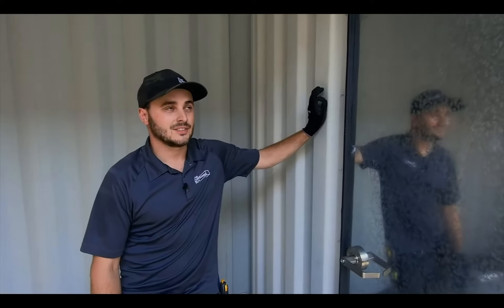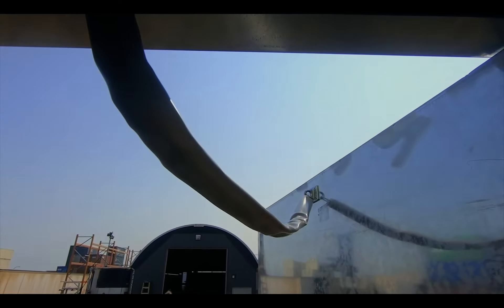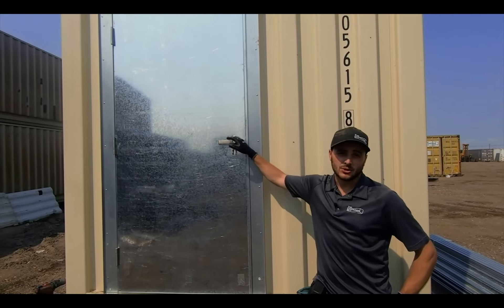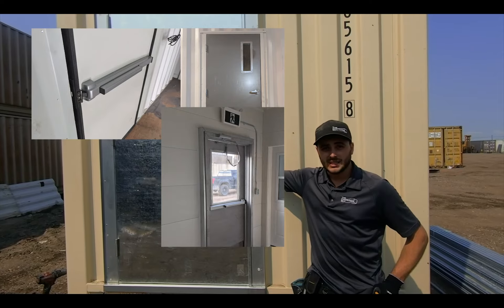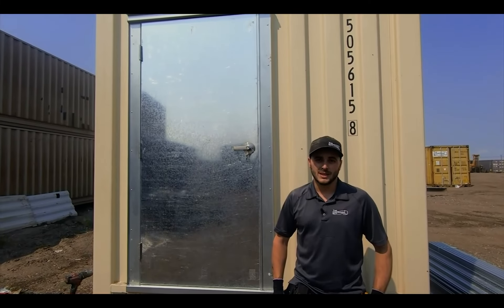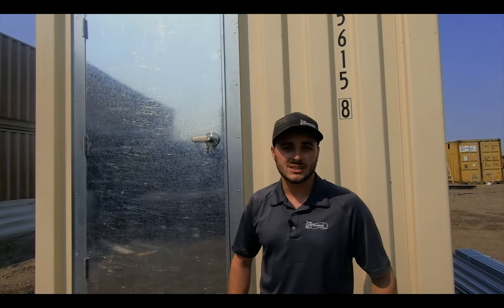The final closing touches for this door: we include standard a storm chain, which installs in the header and on the door. Basically when it gets to 90 degrees or just over, it stops the door from over-rotating and putting extra stress on the hinges. The hardware included is the locking door lever and a storm chain or check chain. Other options available are the panic hardware or crash bar, a sight glass option, a half glass option, and also a self-closing device. That right there is the installation instructions for the Container Modification World Man Door. If you like this video, please give it a like, subscribe to our channel and hit the bell for notifications, or visit us at tcg.ca. Hope you learned something.